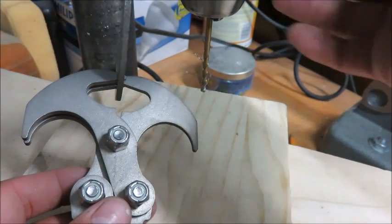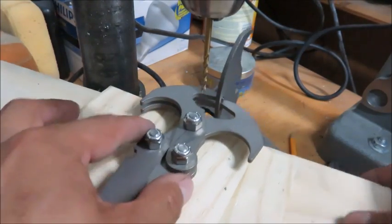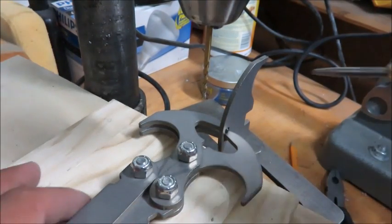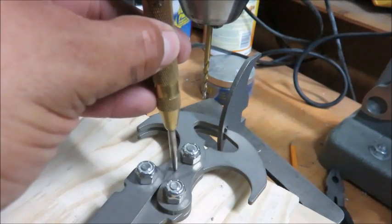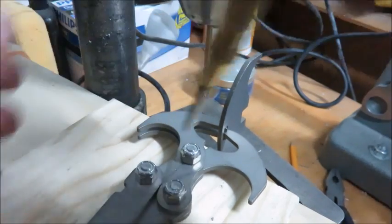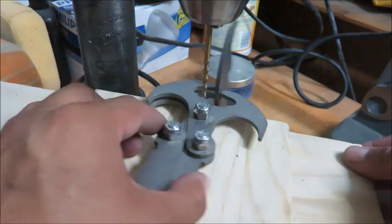We'll start with a small drill bit. This is titanium and I have two pieces of three quarter inch wood. It's important that you use a center punch to mark where the drill bit is going to go — that way you don't have it wandering around. I'm going to do it right in the center here. This one's an automatic center punch, but you can use the old fashioned ones with just a hammer.